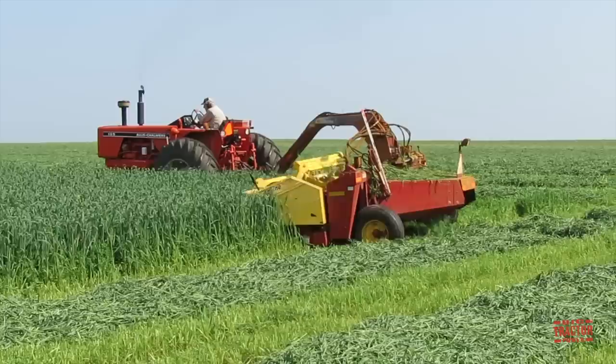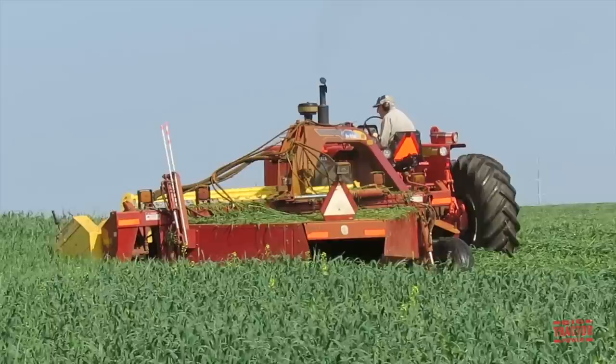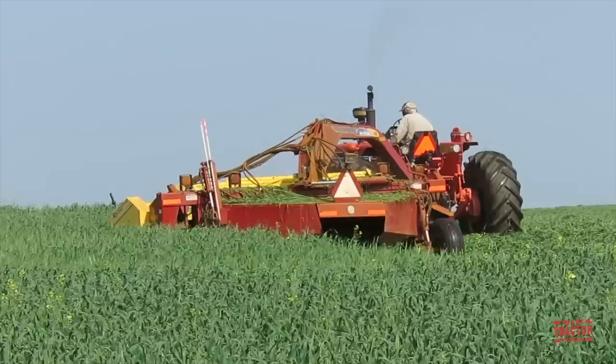The New Holland 499 roller reel is an interesting type of mower. It uses converging tines to sweep the crop in, pulling it into a 12-foot sickle that cuts the crop, and then the crop falls into two rubber chevron rollers that condition the crop by breaking the stems and helping the moisture to begin escaping. This machine leaves a 9-foot swath behind that will start to dry in the sun.